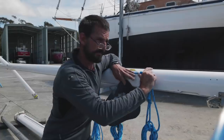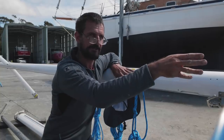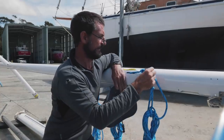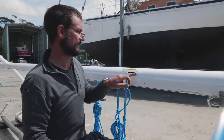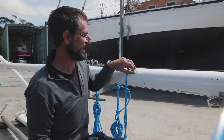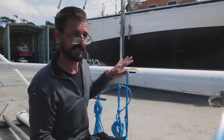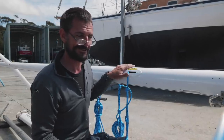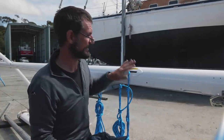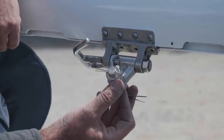So what that means is when the ropes come down the mast, they'll go through a turning block, well, actually a frictionless ring, and then they'll go off to jammers or winches or whatever have you. But this is a totally maintenance-free solution. I took care to make sure that everything is super rounded off in that way. So we're not going to have any more sheaves, no sorts of crazy things that are going to rust, no more fastenings, all of that. It's as simple as you can possibly get. Same old gooseneck attachment, but we're getting a new boom.